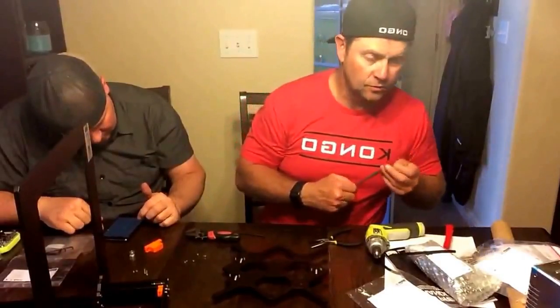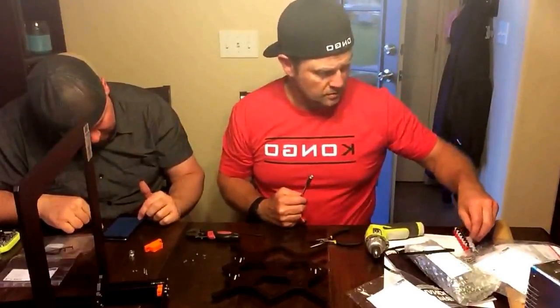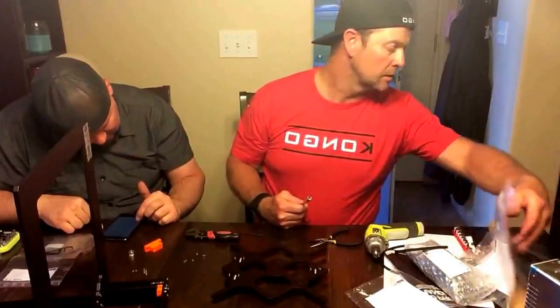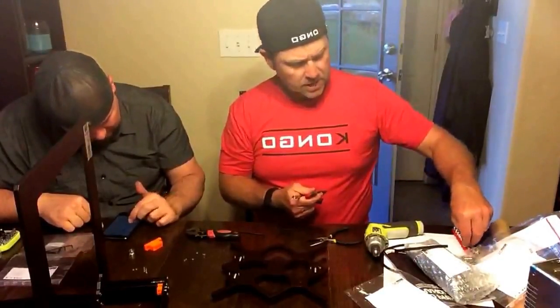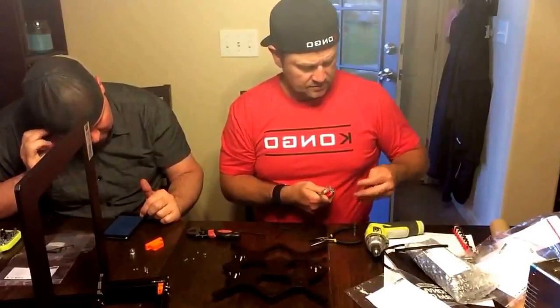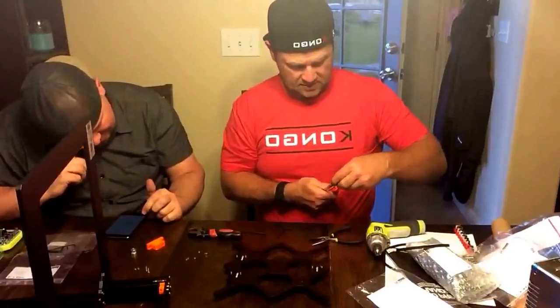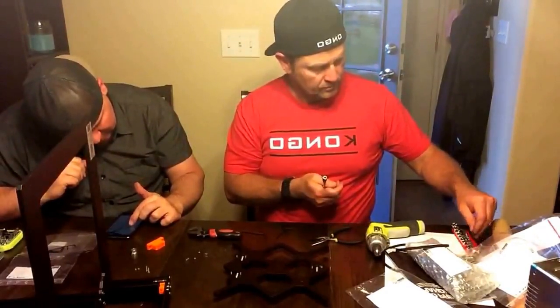I need my other tools. Start tightening the nuts, but ensure, in big letters, you are tightening both nuts equally, and as soon as each nut reaches the surface of the carriage, stop tightening. All big letters. You don't want to over tighten it. Yes, things that people hold on the zip ties, right? Yeah. Repeat this on the remaining two bearings.